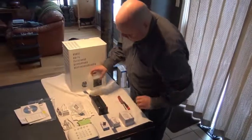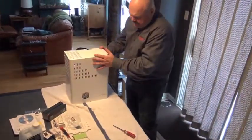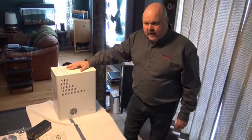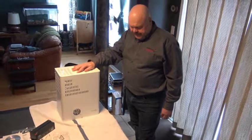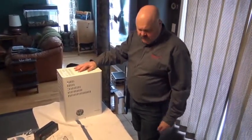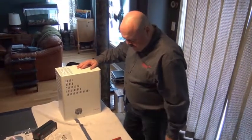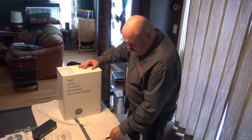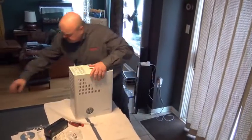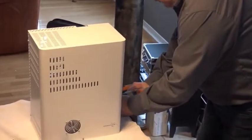The next step is starting the installation process. Generally, a smoke cloak is installed by a certified electrician because the devices all come in 220. Our smallest system, the 600, does come in a 110 version, but you will still in most cases require an electrician to hardwire it to your electrical panel. Assuming I'm talking to an electrician: all that's really required for tools is a Phillips screwdriver and a micro screwdriver for connecting your high voltage power. We're going to use a nut driver on a drill to remove the five screws that hold the cover on the smoke cloak system.